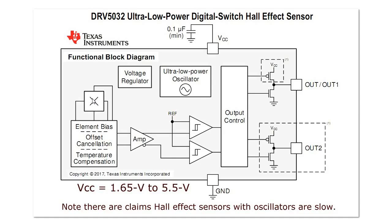There's something you need to know about these types of oscillators. These internal hall-effect sensor oscillators are great — very low power. This one averages about a microamp. You would use it in, say, detecting an opening door or closing a lid on a laptop. This is to be used more as a position sensor. You would not use this to try to count RPMs on a motor shaft, for example.